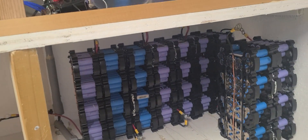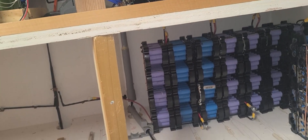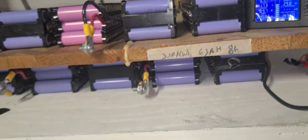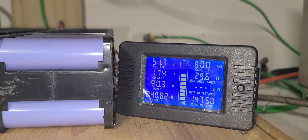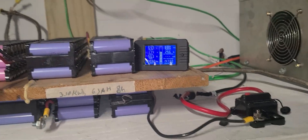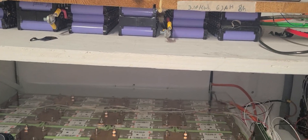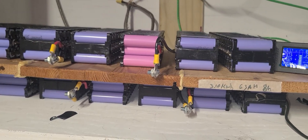To fully charge it, I need at least seven days of non-stop sun. Yesterday there was no sun, so I only get a little charge each day. The battery needs to be at 52V but it's not getting there because I'm using power in the house. Tomorrow morning this will be around 50V, and overnight I use about two amps. Don't forget to subscribe and check out the next update.